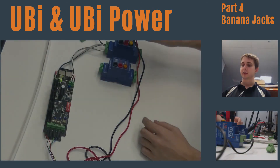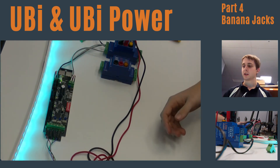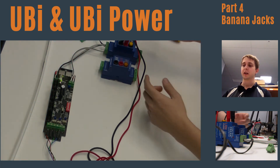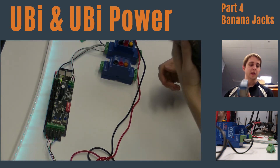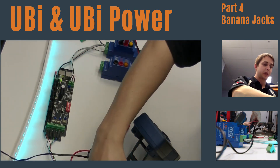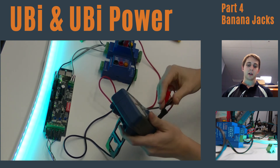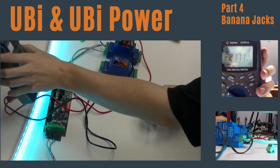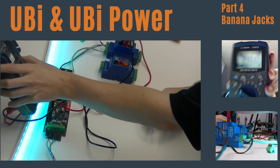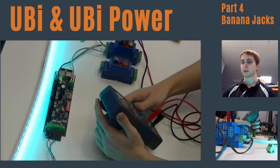The banana jacks on the top of these units are quite handy when you want to connect a tool such as our Addict directly to the line without having to remove any of the terminals. The other benefit is that with a standard multimeter, the red and black cables which come standard with the Addict will fit directly into the multimeter. Then we can see if we get the correct DALI voltage and know that the line should be fine with no issues.